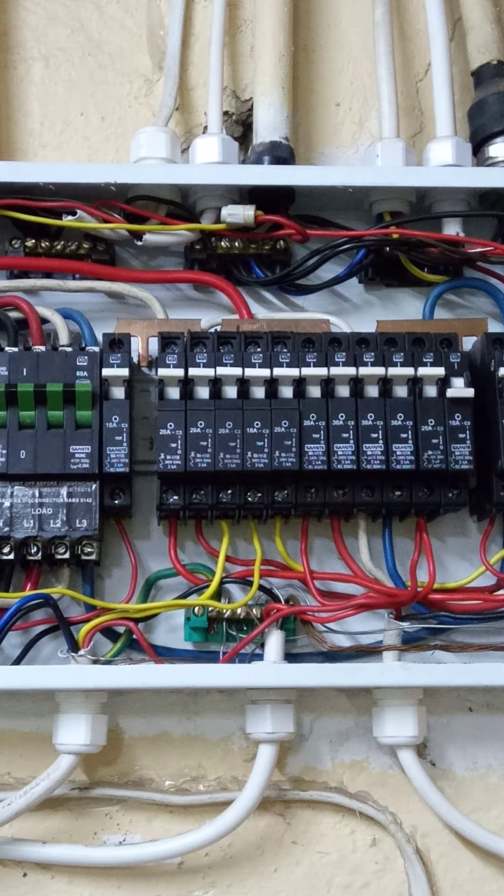This is because there are two single-phase houses on that red feed, and one single-phase on the white feed, and a single-phase on the blue feed — but that house is currently unoccupied. The other houses in the neighborhood are all three-phase, but it looks like they have also been badly balanced in that they run a lot of their loads on that red phase, which is causing this imbalance.